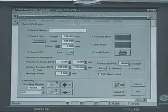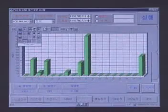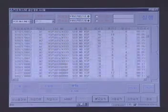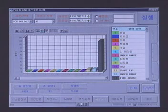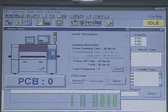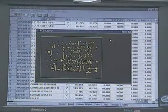All the CP40 series operating software environment is based on the window system to provide a consistent work environment. The built-in production control function enables the operator to easily check PCB production and equipment operating rate. The position and cause of error are displayed on the window screen so the operator can promptly and easily take appropriate action. The multi-CPU installed enables data preparatory work to be carried out on the next PCB even during equipment operation.